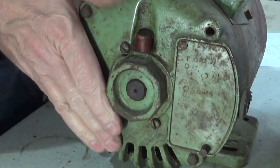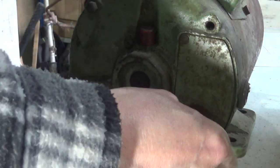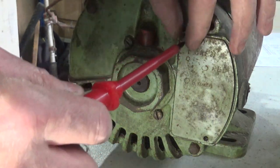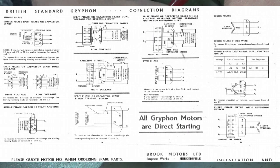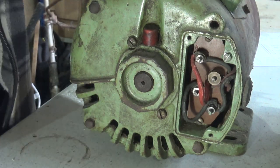It's quite a heavy motor, but it's about 70 years old and still runs sweet as a nut. I've probed it with a multimeter all over the place — it's obviously had some weirdness done to it over its life. I'm going to put up a screen print of various wiring diagrams. The Griffin comes in a number of different alternative styles: three phase, two phase, and in this case either split phase or single phase with a starting capacitor.